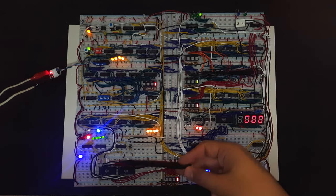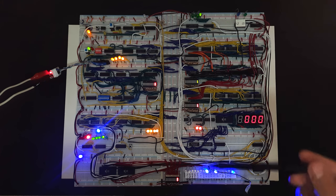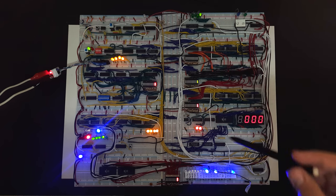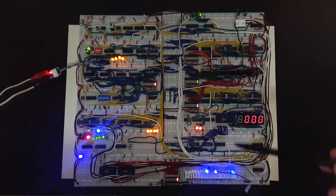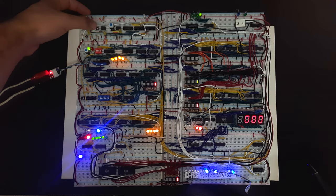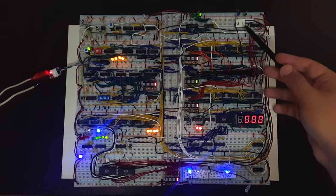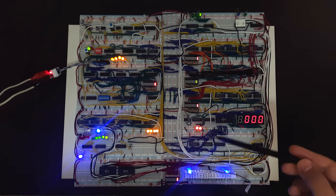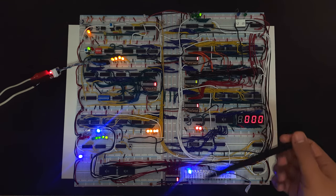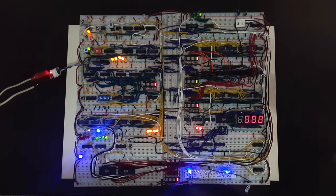The final part of this instruction is 'load A' — it's going to load whatever's on the bus into the A register. It's telling it to output the ALU output, which is one, and update the flags register with FLD (flag load). If we pulse the clock, the flags register updated but it's both zeros because there's no zero or carry. We got a one into the A register — basically loaded what was in the ALU.